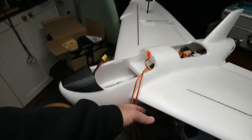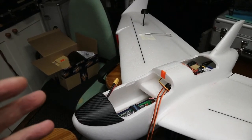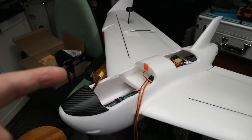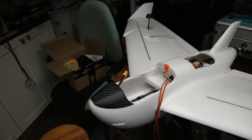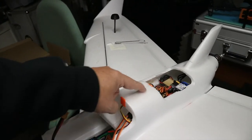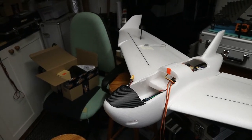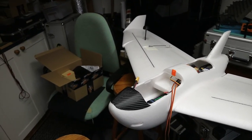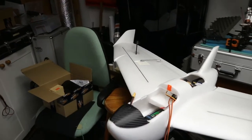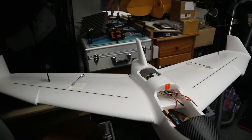That's where we're at — a pan and tilt camera system on the front. I'm not going to put the system in just yet, because I want to do some tests; I want to test fly it before I start putting FPV on it. For the OSD, I'm going to use the Aeromax OSD from Virtual Pilot — absolutely superb — it'll have a GPS pack, which will go on top there, so I'll get a full OSD with location and direction home. No return to launch or return to home features, but it will point me where to go to get home. With the EZ UHF I'm not going to be going too far, because I've got 5.8GHz video so my range is limited — it's just to have fun flying around and at least know where home is when you get up there and everything looks the same.